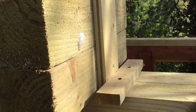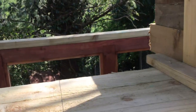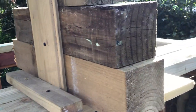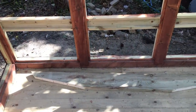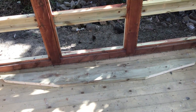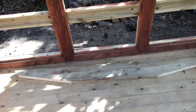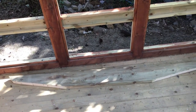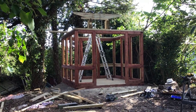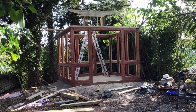I've secured the temporary support for the ridge into place. It's only temporary, so as soon as I need to remove it to fit the rafters I'll be able to move it along as needed. That gives you an idea of the shape of the ridge. As you can see, the centre section has three rafters going in there, and a further two to the left and to the right, and it will be curved to make it look the part. The ridge is now in position — I just need to measure the rafters, secure them, then take the scaffolding away.